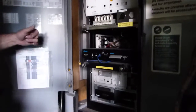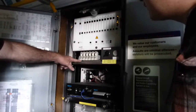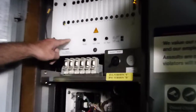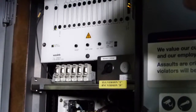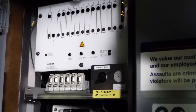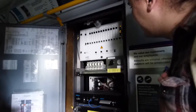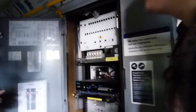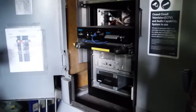This is like the health center — it delegates to various other modules what to do, and that's what we always look at. All these modules have access here. This is from the roof for the propulsion. This is the ZLG I just talked about. These three are mounted in the box upstairs. All of this is a wire extension — that means I can go in here with my laptop, take a download of events, get all that data, look at it, and say okay, we've got a bad module, a bad contactor, or the motor is on its way out. You can find it from here without having to go dig around.